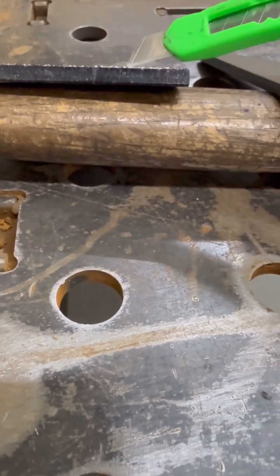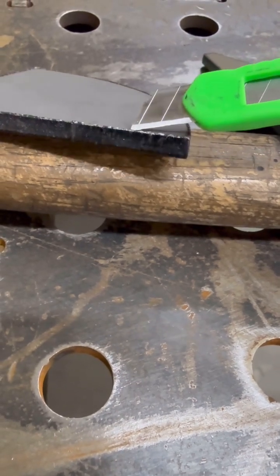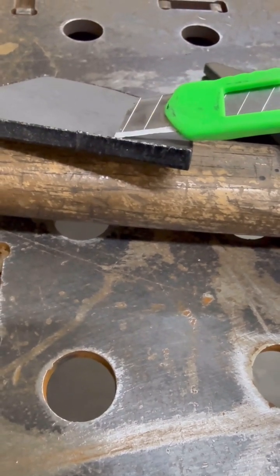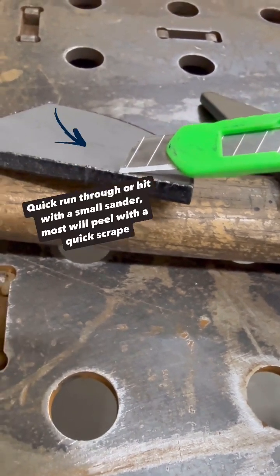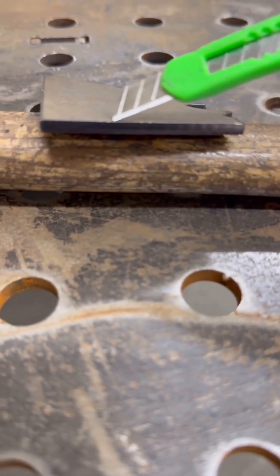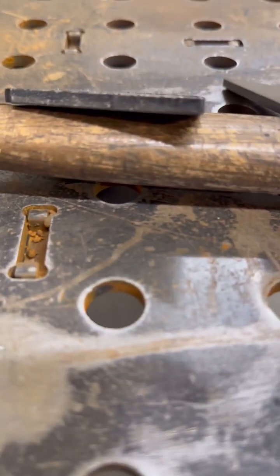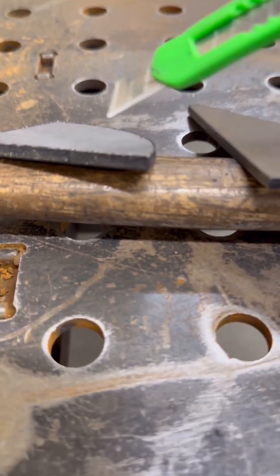Here's carbon steel cut with air — a little bit more of a dull edge quality, and you're going to get a little bit of this dross, which comes off very easily. When cutting with oxygen you're cutting at about 165 inches per minute, and when cutting with air you're cutting at about 330 inches per minute.